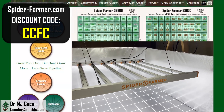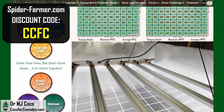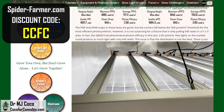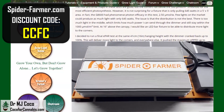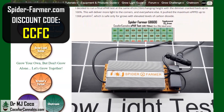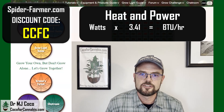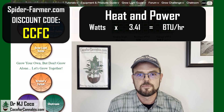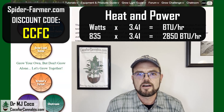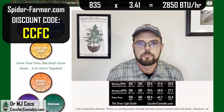After the PAR and ePAR tests, we measured the surface temperatures. The tops of the LED bars hit 46.8 degrees Celsius (116.2°F). The Spider Farmer driver hit a high temperature of 58.2 degrees Celsius (136.8°F). The amount of heat the G8600 adds to your space is a function of the power draw. If you run it at full power — about 835 watts in my tests — it will generate about 2,850 BTU per hour.